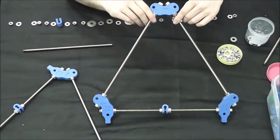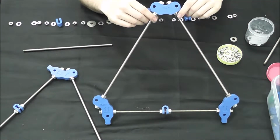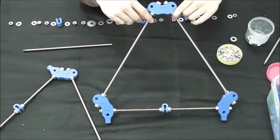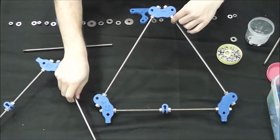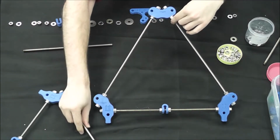And the most important thing about this assembly is that you have to make sure all the distances here, and then here are the exact same length, and we shoot for about 290mm. So whether or not your rods will be flush at the top or sticking out a little, it's pretty irrelevant as long as the insides are the same measurement. And we did that both sides equal, completely exact same build.